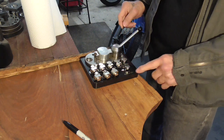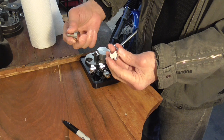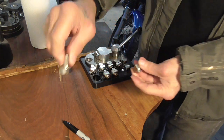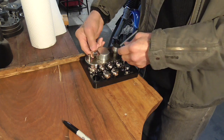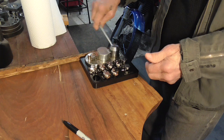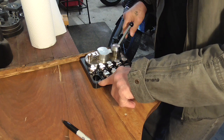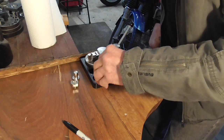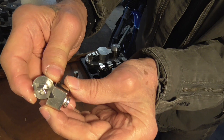Very attractive package. Now, this is cut out and marked where each of these matching mandrels go. And the way this works is you have a round piece that drops in here in the bender, and then you have a matching piece that just drops onto this. Put your metal in here and push this. I'll do a close-up later on and show you. Now, in case you don't know where these go, they're marked. Like this is a 60-degree mark, and that's for bending sharp angles.